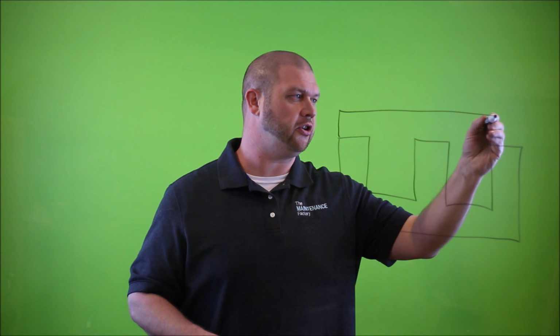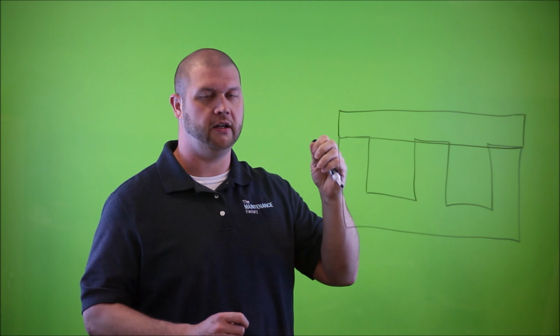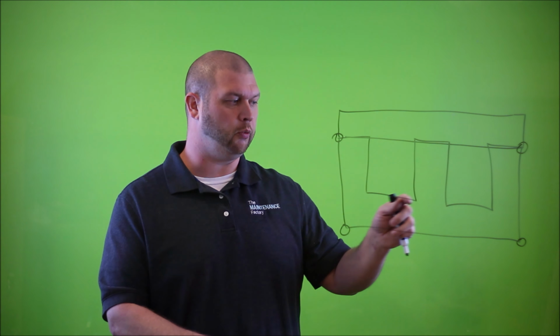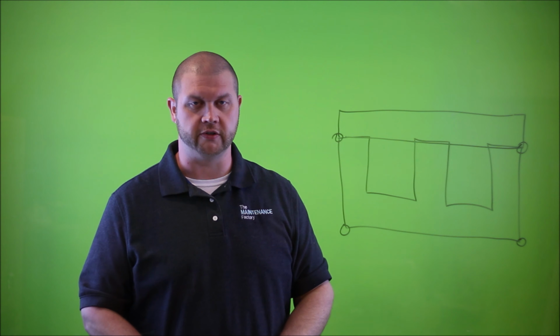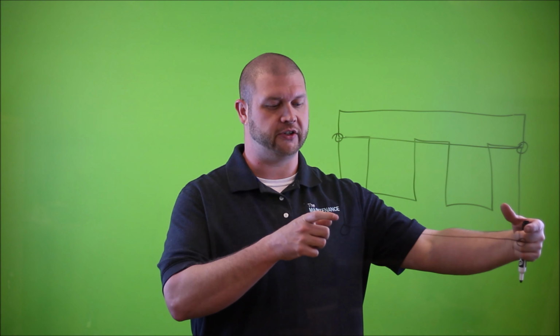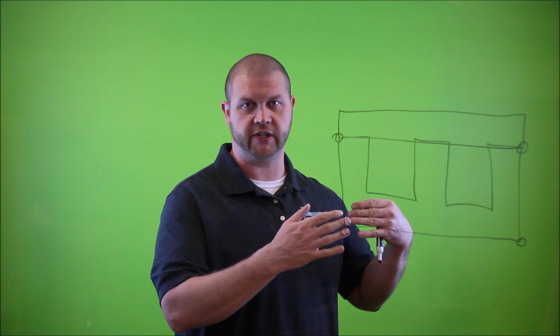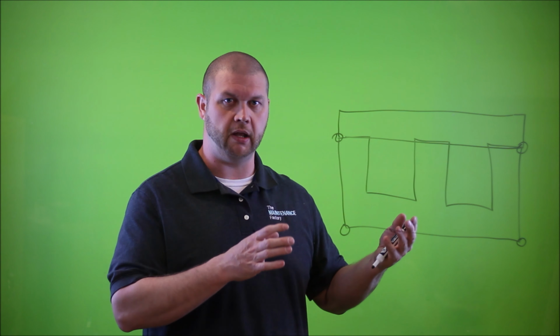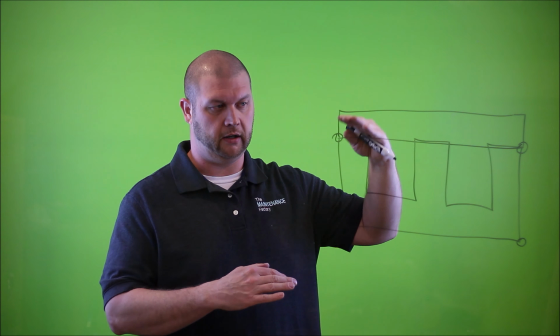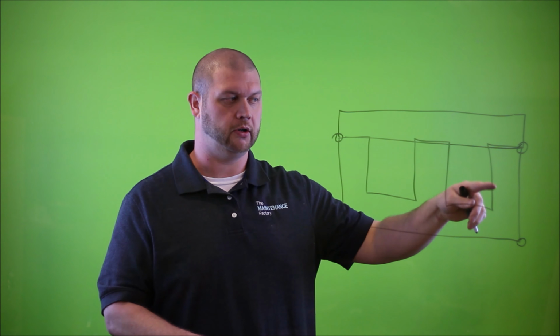There's also another steel crossbar on the top, which again is also made of many lamination segments, and they're also welded here, here, here, and here. These 4 weld points correlate to the 4 weld points on this larger transformer, and they serve really 2 purposes. The first is actually to hold the laminates together to keep those from separating and to provide some mechanical stability to the core. These top welds here actually serve the same purpose, but with the addition of maintaining the top crossbar in close relation or contact to the E-shaped core.